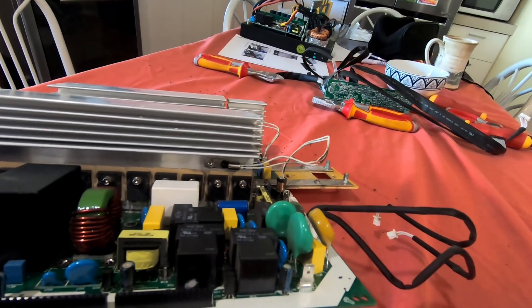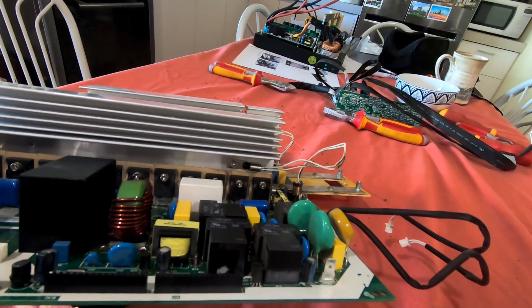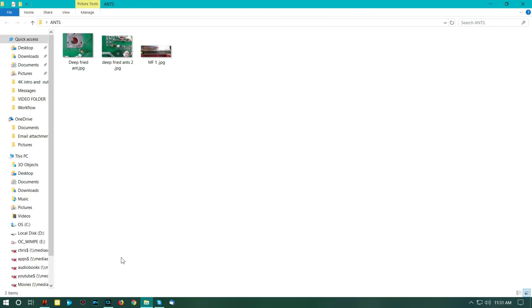This unit has been in service for five years — cry and shame. We finally found out what killed this inverter, and yes, it was my own stupidity, my own forgetfulness to maintain the ant barrier with surface sprays and other chemicals. Remember: when you spray for ants in your shed, power room, or wherever, turn all your charge controllers and inverters off. They've usually got fans in them, so just shut your system down to do this job.